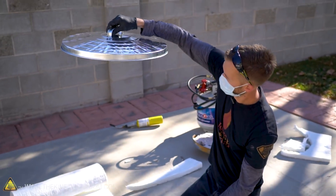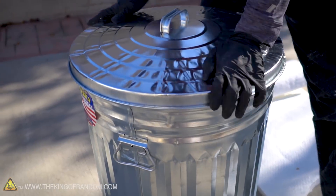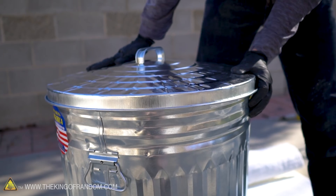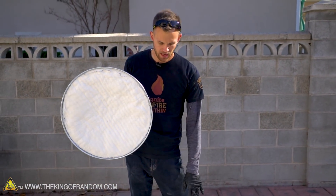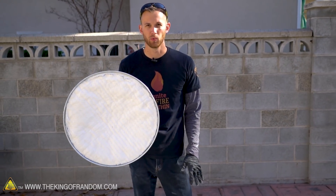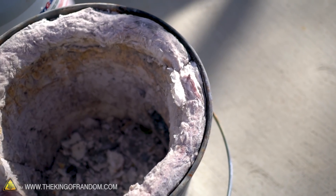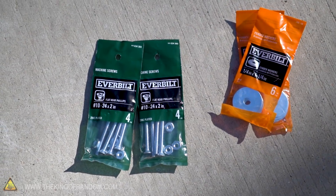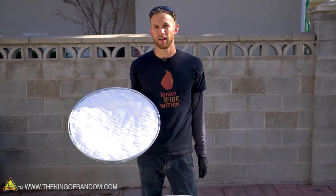That's what we're hoping for. Let's give it a try throwing it on our can — beautiful! That should be one insulated trash can. Now we've got the walls and the lid covered in our insulating kaowool, and it's holding itself on really well. But with our mini foundry, over time as it got heated up and cooled down repeatedly, the kaowool lost some of its rigidity and began to slump. So I've got some hardware and I'm going to use that to attach the wool to both the lid and the sides of the trash can, so that down the road we don't run into that problem.